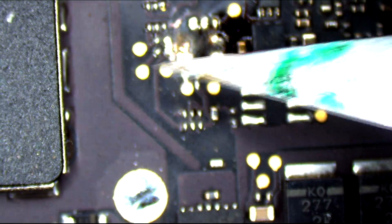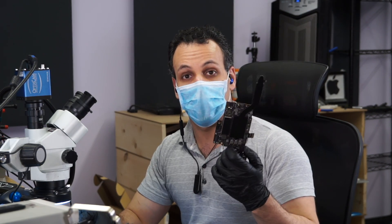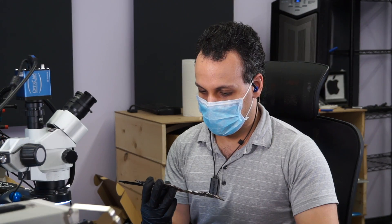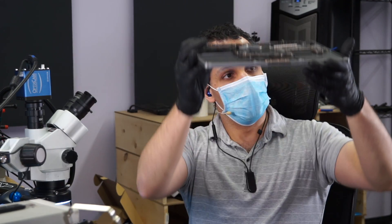In this section it's all the way through, so this is not something that I can fix. I could scrape this until the cows come home but I'm never going to be able to scrape through that without destroying the entire board — at which point there's no point to removing the short. To fix this board would be like removing a cancer that spread to the entire body; to remove the cancer you have to kill the person. This was not in any way liquid damage, and I hope you can use this video when you go back to the Apple store that told you it was liquid damage and give them a middle finger, because that's what they deserve. Unfortunately, this is not a board I will be able to repair.